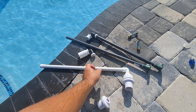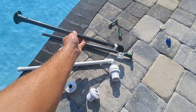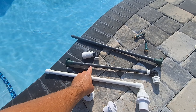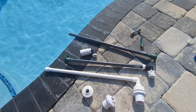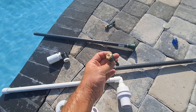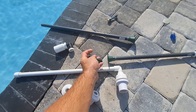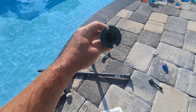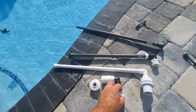At 100% or 80% it'll almost shoot over the pool. For reference the pool is 16 by 36, about 17,500 gallons. For this other little trick — we had these compression fitting jets, everything you find online for sprinklers are all threaded. Well I don't have threads on mine, so I had to try something different. I got five slip-in ones on Amazon for fifteen dollars, but nothing fits inside these — they're either too big or too small — so you're gonna have to get a file and file some of them down.